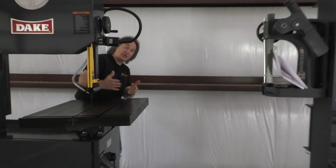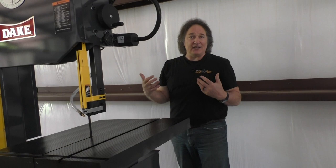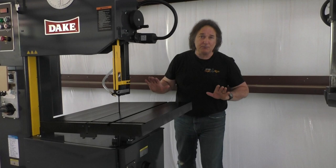You also want to leave some room so you can put long pieces in there. One of the things you might notice — I usually keep my tools on pallets. The reason being that I can keep them up against the wall when I need them, but if I have to pull them out, I can just put a forklift or a pallet jack under there, pull them out, cut a long piece, and roll them back against the wall. Because you do have to have room to get back in behind these things.